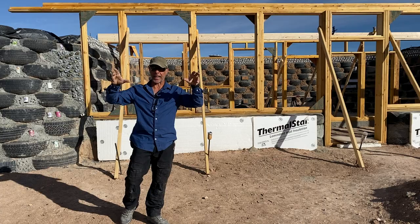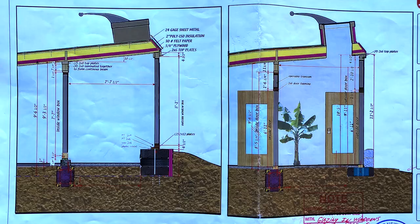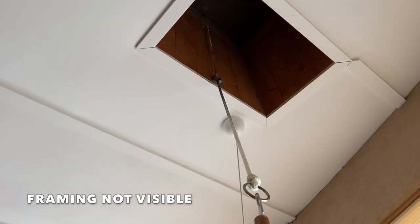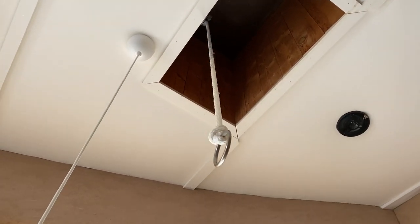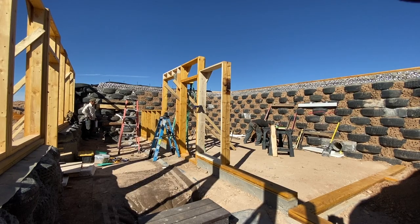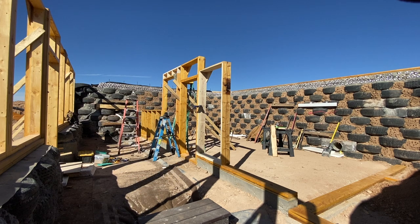An important thing when it comes to the front greenhouse is prepping for the skylight boxes that go over the two-by-twelves. A lot of people question this detail, but for strength and framing inspection approval, we let the rafters run all the way through and put the box on top. When you look up you do see framing inside the skylight box, but that's where you can hang your cam cleat and run your ropes. I like it for stability, especially with high winds — it locks down that big box and heavy lid tighter to the greenhouse roof.